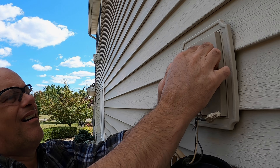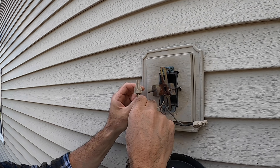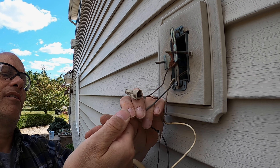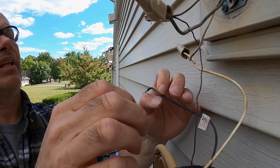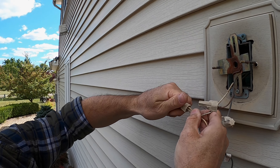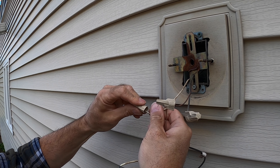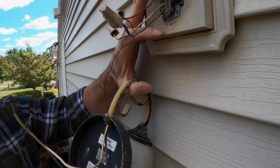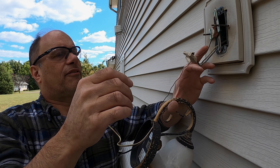One of three things happens with these light bulbs when they break — they usually leave shards of glass hanging down. You can take a pair of needle nose pliers and work it out. Some folks will take a potato, cut it in half, push it onto the glass and open it up that way. I would definitely use safety glasses and gloves. I'm sure the power's off. I can actually unscrew this bulb right out of there.